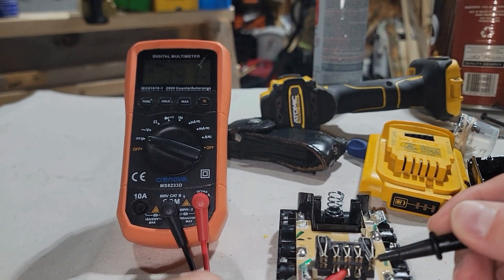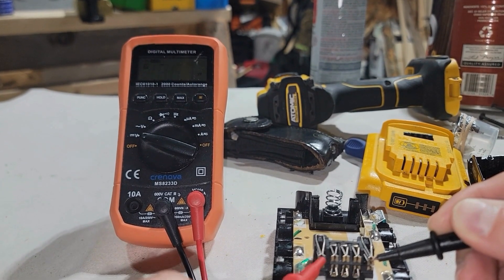Remember, you're pressing down on a very thin metallic foil-like substance, and piercing it will be absolutely terrible for the battery. Some batteries may allow a very fine small flathead screwdriver, but with DeWalt batteries you can get nothing more than maybe a small paper clip inside. Once the CID is reset, you'll likely see a voltage come from that cell when you test it with a multimeter — if it hasn't already done something catastrophic. From there you're free to do whatever you want with the battery, but know you're playing with fire. This is like a ticking time bomb: it might be fine for the rest of the battery's life, it might last one or two charging cycles, or it might do something catastrophic the first time you use it or plug it into the charger. Don't say I didn't warn you.